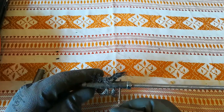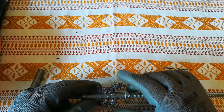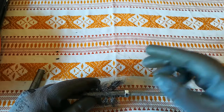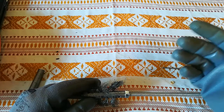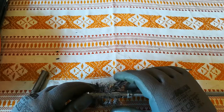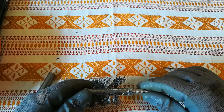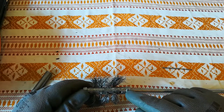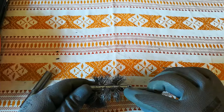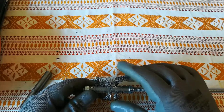You cross drill it and then you cut the length of this steel cable to slightly larger than the diameter of the pipe — for example, the pipe that you want to remove rust from, or paint, or whatever you are going to do with this. Once you've drilled the holes and inserted your steel cable inside, all you have to do to lock it in place is loosen this nut and tighten this nut. As you do that, it's going to shift and you will end up with two eccentric holes that are going to hold this steel cable tightly in place.